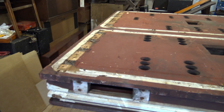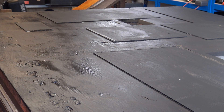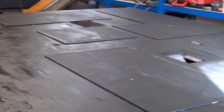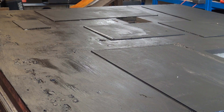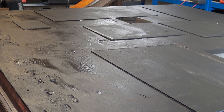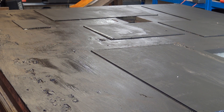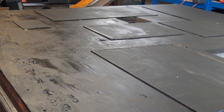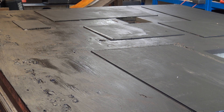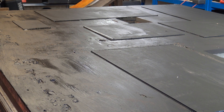Early the next morning, we've still got the paint drying and it's going to need a second coat. I know this is going to be underneath and nobody's going to see it until the organ gets another overhaul in perhaps 75 years, but I just like to be spot-on. You can see all the holes which went through to the feeders — the removed feeders are now boarded over with hardboard. We've made sure the tacks are flush, sanded over with emery cloth as well. Remember, this is the bottom — in a few days we'll go over it again with the black paint.